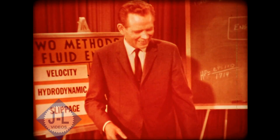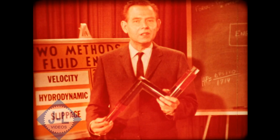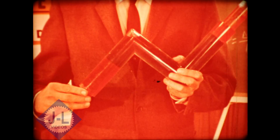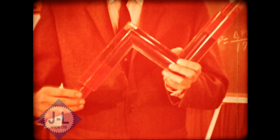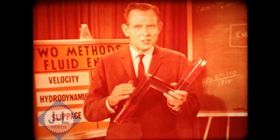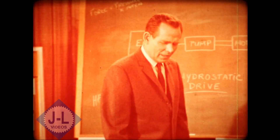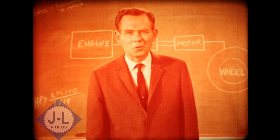Now, why don't we use a solid? Well, this model will demonstrate — a fluid can go around corners. Positive, direct. No problems of slippage, as with vanes or turbines. Just a few reasons why the piston and cylinder method is used to transmit fluid energy in brakes, lifts, steering, and so many other applications. Essentially, the same piston-type pump is at the heart of the whole system.